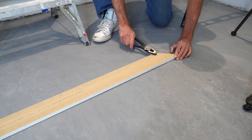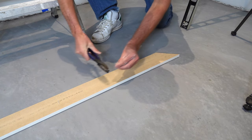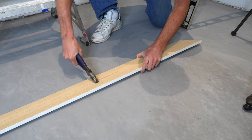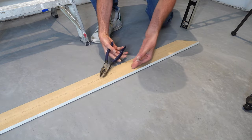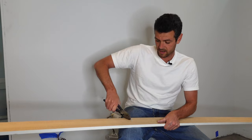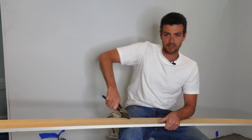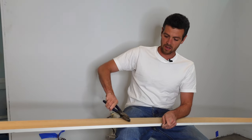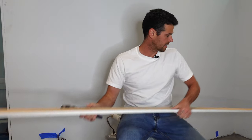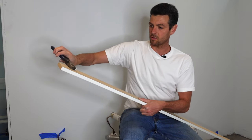Last but definitely not least, a good old pair of linesman pliers — these might actually work better than the needle nose because they're a little bit bigger. Linesman are actually the best and easiest ones to pull nails out with. Definitely the simplest tool you're most likely to have on hand. While the channel locks worked really well, they're kind of big and cumbersome and you have to have them set up to use nicely. Linesman are definitely the most user-friendly — you can do it standing in any position.